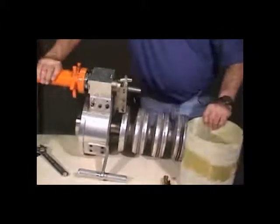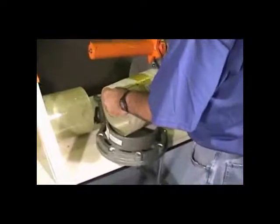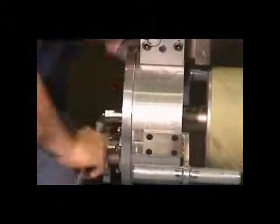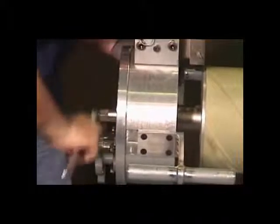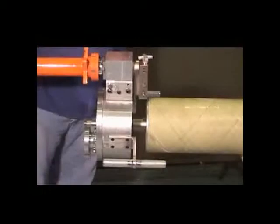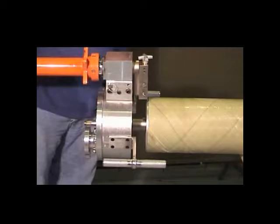You are now ready to make the taper. Now we'll measure the factory insertion depth. Insert the tool into the plain end pipe, then tighten the mandrel. Support the tool as mandrels are being tightened to ensure that the tool is centered in the pipe. This is very important — if the tool is not centered correctly, the tool may cut off center, resulting in a thick, thin condition.